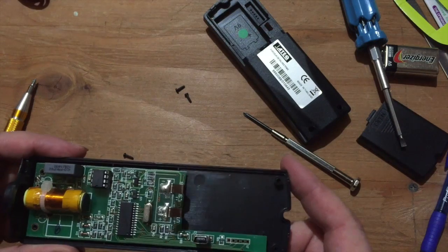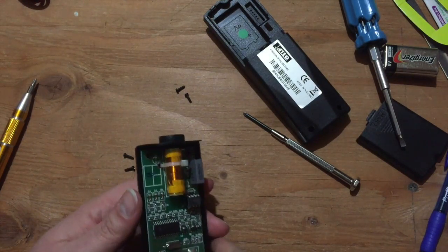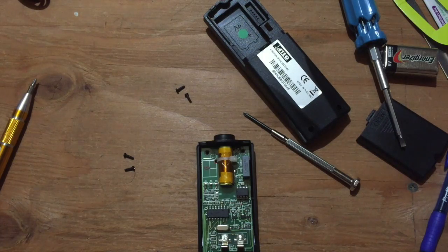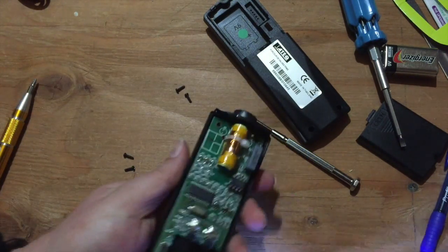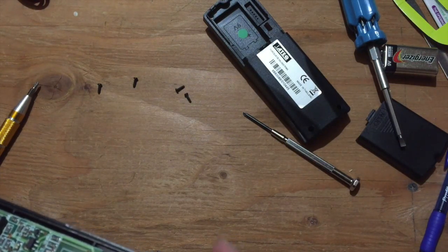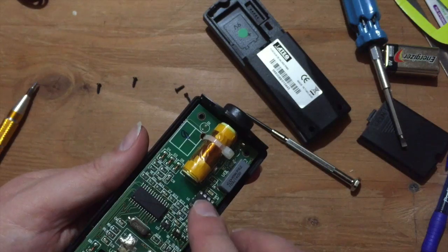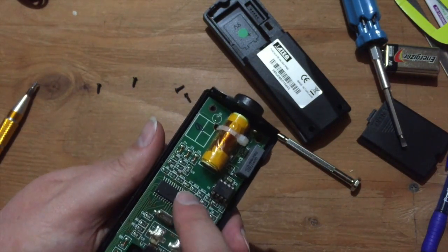And indeed that is a 5-pin header, J1. I can see what I think is the Microchip logo there, so I think this is indeed a PIC. Let's see what this chip here is. All right, so this is a PIC 18F2455. So that is not an RF PIC — I think that's just a pretty standard PIC18 type. I'm guessing that this other chip here drives the RF side of things, and that the PIC18F2455 has the built-in USB functionality.